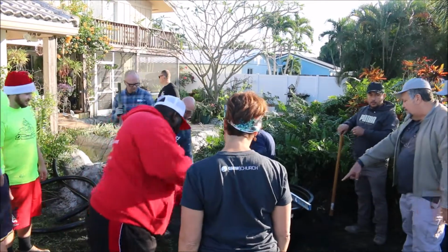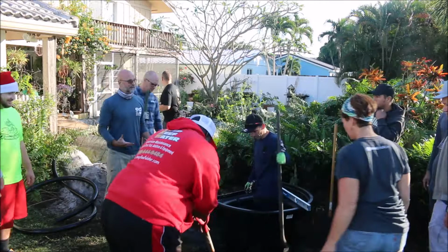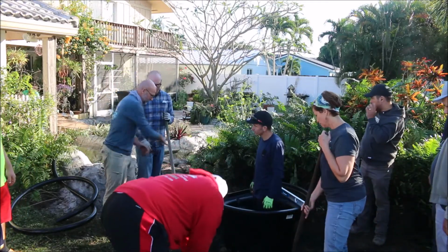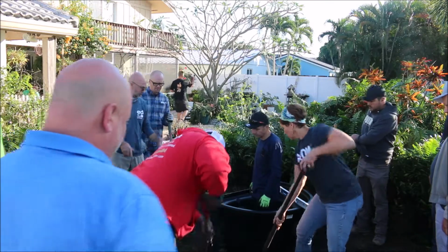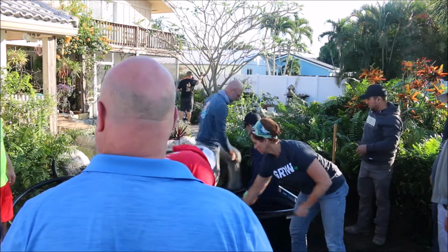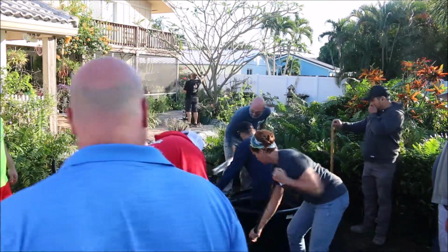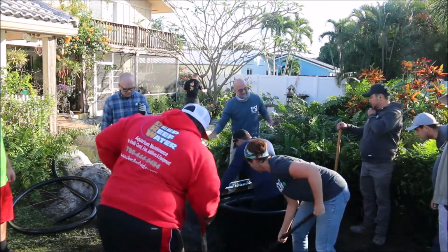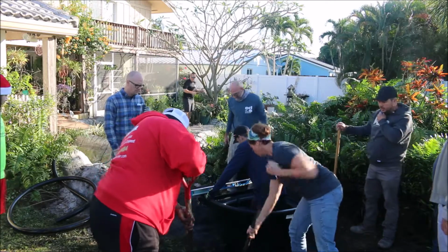This is just a plastic shell. We're gonna start backfilling it to lock it in place. If you don't have somebody standing inside of there when you're backfilling it, you're gonna knock it out of level. So your job is not just to stabilize it, but to be looking at that and make sure that it's staying level, so when we're backfilling, it doesn't get knocked out of position.